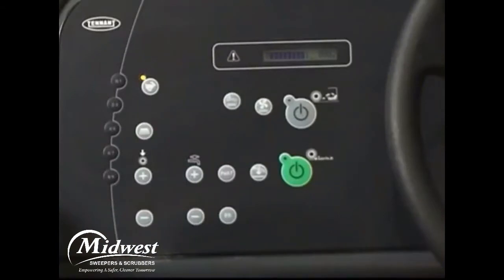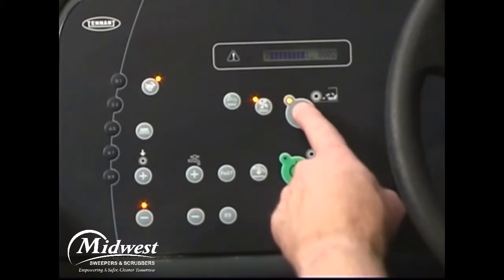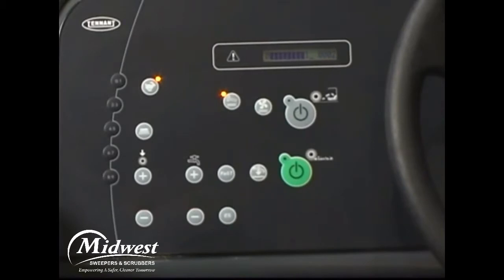Your machine is designed to dry sweep and control dust when you press the one-step sweep button. When pressed, the LED near the button will illuminate, the sweeping system vacuum fan will automatically turn on, and the vacuum fan LED will illuminate. When the one-step sweep button is pressed again to turn off the sweeping systems, the light turns off and sweeping functions stop after a short delay. The sweeping dust control filter is equipped with a shaker that cleans the filter and provides excellent dust control. If this filter is clogged, a warning fault is displayed and the operator should activate the shaker system to clean the filter.